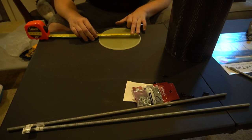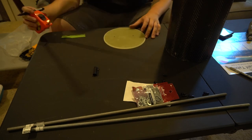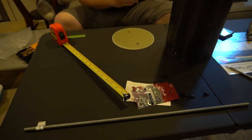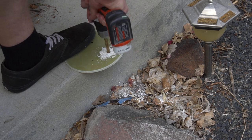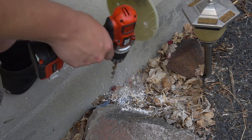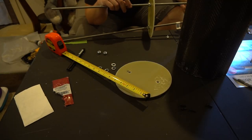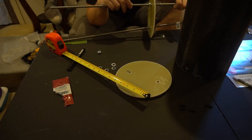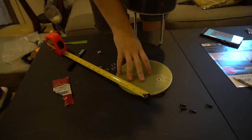Using advanced eyeball technology, I found the perfect center of each of the electronics bay bulk plates and marked where I was going to drill holes for the three-eighths-inch all-thread that's going to hold the electronics bay together. I stepped outside and drilled three-eighths-inch holes in each fiberglass bulk plate, being sure to cover the spider web beneath with fiberglass shavings I'd rather not have in the carpet. Then it was simply a matter of lining everything up and running the all-thread through the coupler into the bulk plates, assembled with three-eighths hardware and locking washers — because on such a big rocket I don't want things rattling apart.